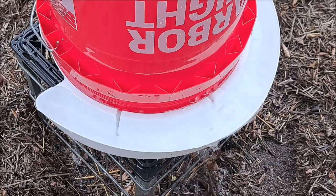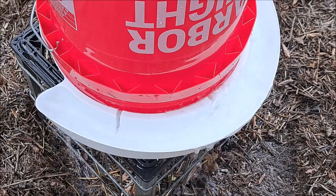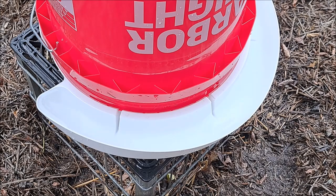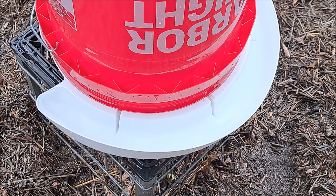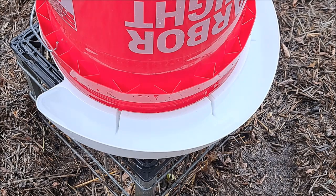I have my hose on now and we're filling. Per the instructions, it says to continue filling until the bubbles stop. The bubbles have stopped and I've turned off my water. You have to leave the hose either connected to your faucet, or leave the fill end of the hose higher than the bucket — otherwise all the water would come back out through that way. It's just for auto-filling. But the other advantage is that in the minute and a half it took, it's almost like a whirlpool throughout the entire trough — the trough is bubbling and flowing, and it's a self-cleaning feature that will help keep the trough nice and tidy without having to do it yourself. Of course eventually you still have to clean it, but a lot less than you would otherwise.